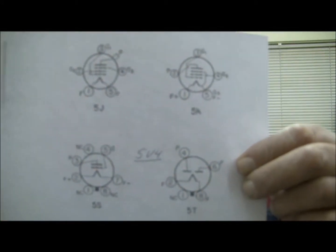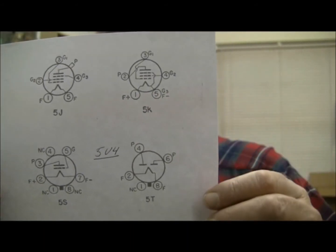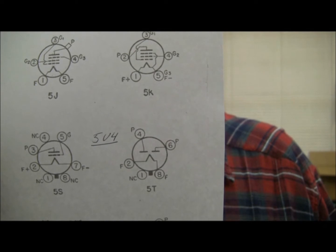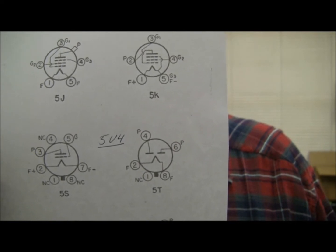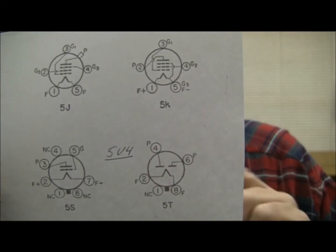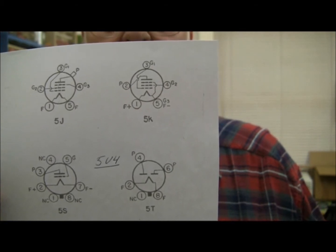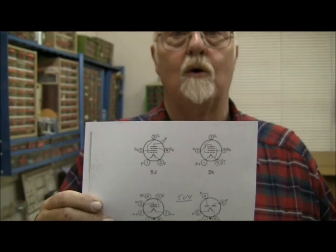It's a very simple thing on a diagram — let me show this to you right where my finger is. This V in the middle is both the filament and the cathode of the tube. It's like the diode: when you see the arrow and the line, the line at the end of the arrow is the cathode. There are two connections to that cathode, because that's also the filament. In order for it to give off electrons, it has to be heated.